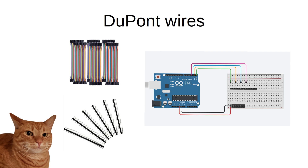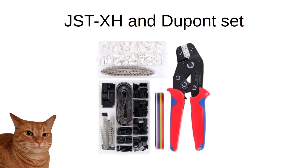If you look at the graphic on the right, you can see how you can get a little extra room between pins and help reduce the risk of blowing up any components on your board. Another good thing to have handy would be a JST-XH and DuPont connector crimp set, which lets you make your own cables for about 90% of the sockets available on most control boards. There are some outlier components with different connectors, but that's a whole other ballgame, and crimp kits are pretty hard to find for those sorts of connectors.